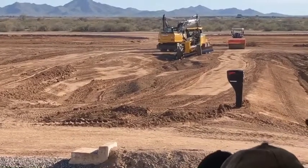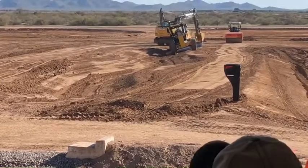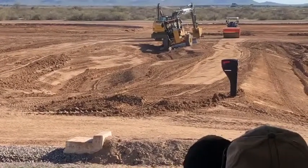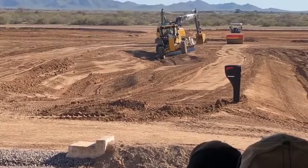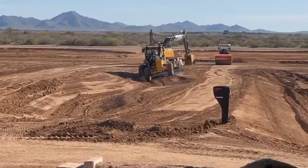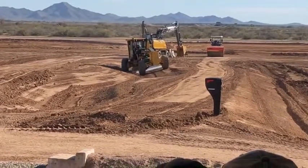As he comes down the middle, what you're going to see is this V-ditch. If you wouldn't articulate through this, it would make for an awful tough ride. But with auto articulation, you're going to see Ben articulate. He's going to leave himself with a little bit of wheel lean on the front, and what that's going to do is allow him to stay up on that slope.